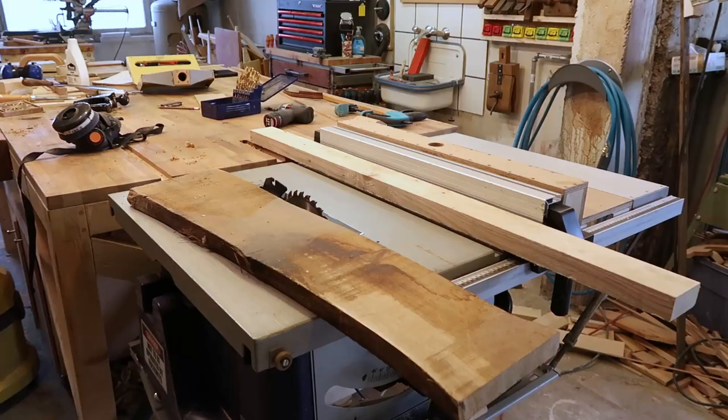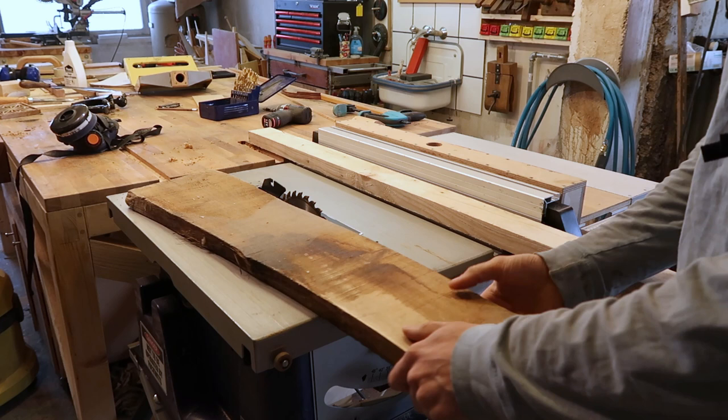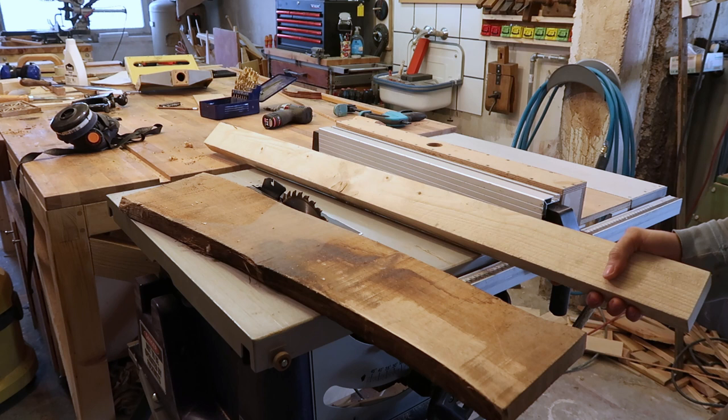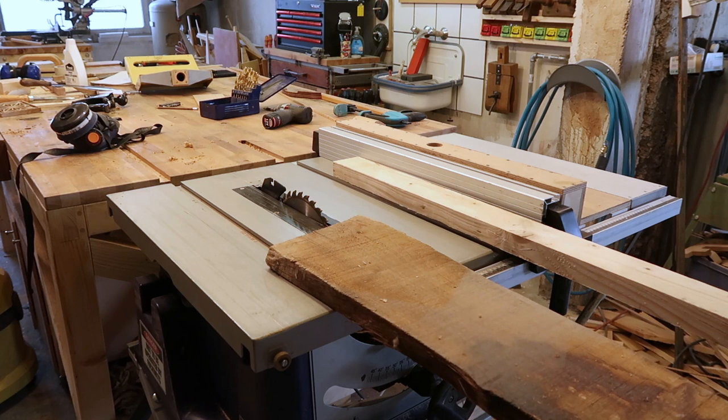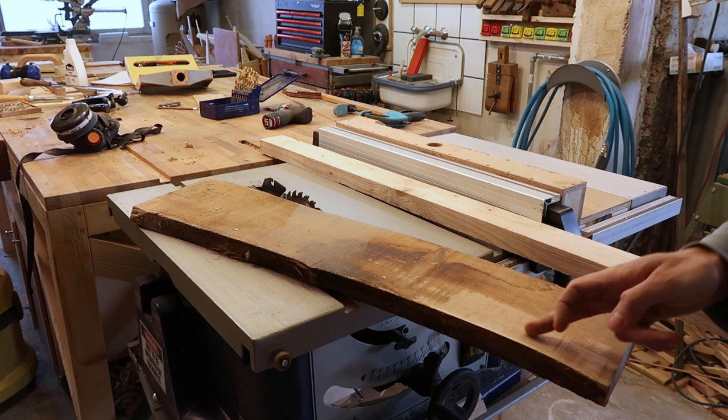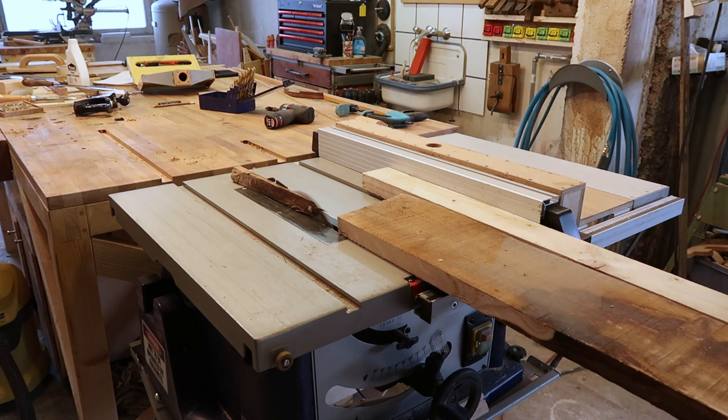If you're trying to mill up a board which doesn't have any single flat face on it, there's a good trick using a table saw. You can take a reference board which is straight and longer than the board you're trying to mill, put the long straight board up against your table saw fence, put your board against that board, and push the whole thing through the table saw. That will give you one edge to start all your jointing and planing operations from. Here's a second pass on the table saw — this is a great way to mill up boards if you don't have a jointer.